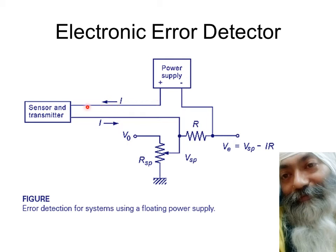Some amount of current goes to the sensor and transmitter, and the same current comes out. This current primarily depends on the value sensed by the transmitter. This current I is normally in the range of 4 milliampere to 20 milliampere. When the sensor senses 0% output, it allows 4 mA to flow; at 100% it becomes 20 mA; at 50% it becomes 12 mA. So this current is indicative of the sensed quantity — temperature, level, pressure, flow rate, etc.